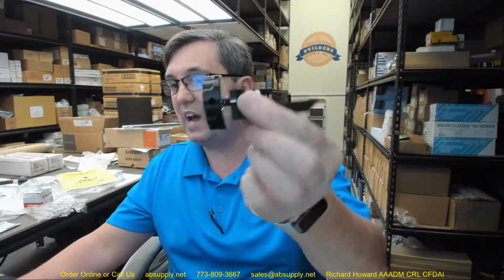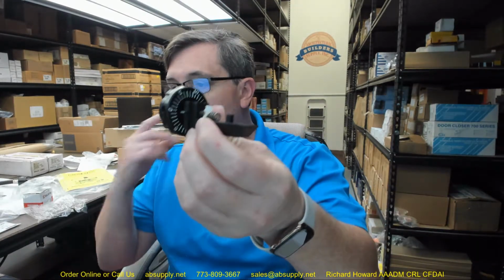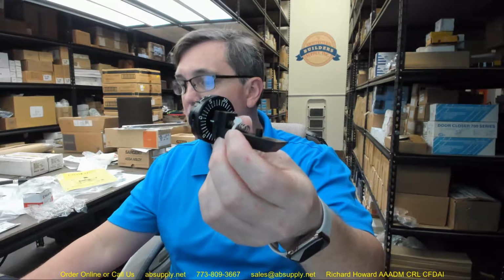Before you begin, please make sure both vice jaws are in the A configuration. Depth is adjusted by moving the stylus forward or backward by means of an adjustment dial located on the back of the stylus. Secure the 2 matched key blanks, 1 in each jaw. Clamp the keys into the vice jaws with about a 32nd of an inch gap between the bottom shoulder of the key and the left side edge of the vice jaws. Do not bottom shoulder the keys into the vices.